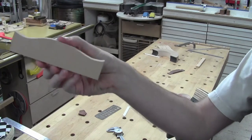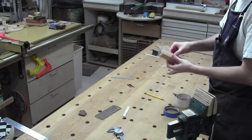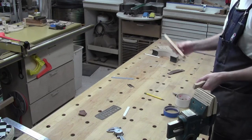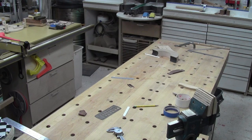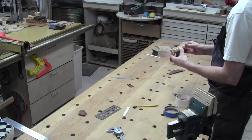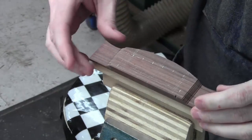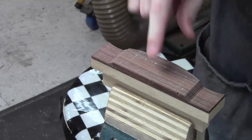Done with the cutting. I'm going to mount this — I'll stick a bit of vertical MDF to this so I have somewhere to grab it. I can grip it in the parrot vise and hold on to the thing. I'll cut this off real quick, just need it somewhere in that area. Now we have that. I'm just going to quickly glue this on, then bring you back. We've got our little platform — about the shape of the bridge plate — with a bit of double-stick tape on the back, and I'm going to stick it to this platform.